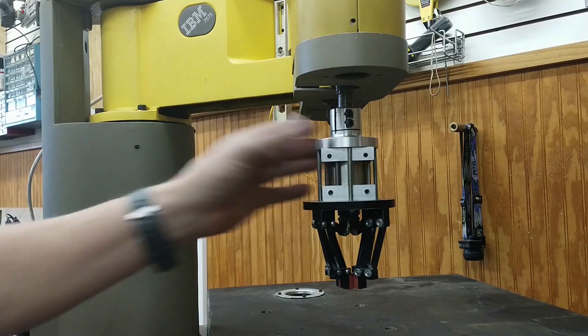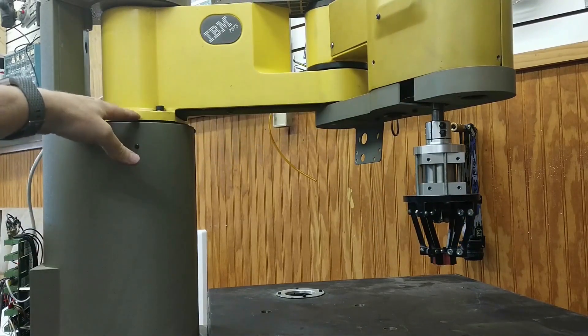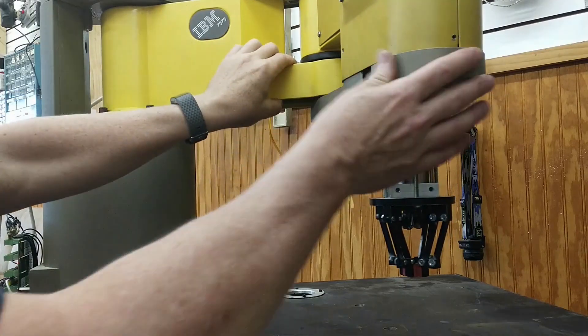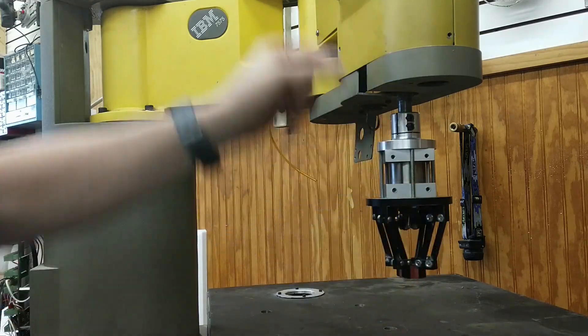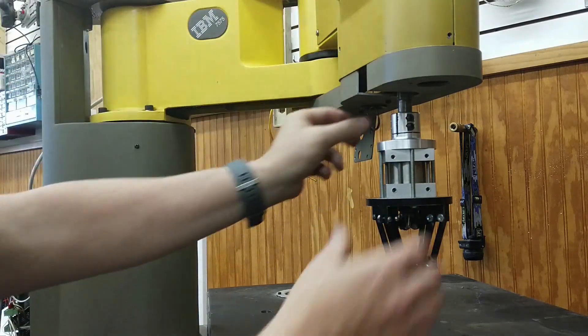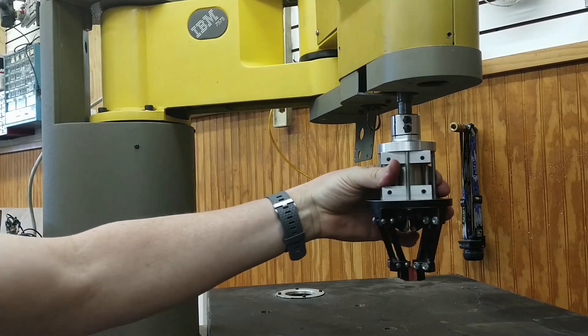I hope that what we do can serve as a starting point and somebody can come along and improve this in the Path workbench and add additional features. So let me give you an overview of what I have in mind for Lenny the Big Dumb Bot. Lenny is a SCARA-style robot with a shoulder joint that rotates around the pedestal, an elbow that rotates at the midpoint, and a Z-axis shaft that travels through the head and can move up and down.